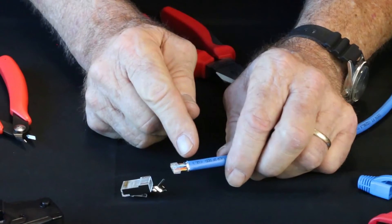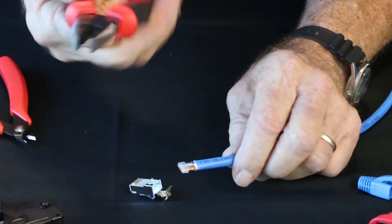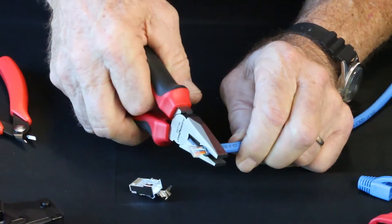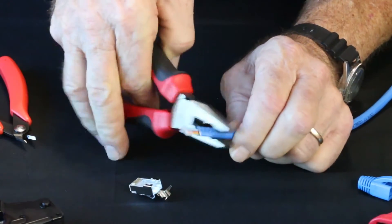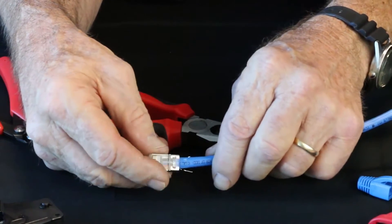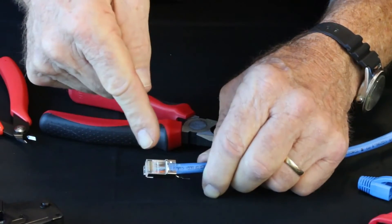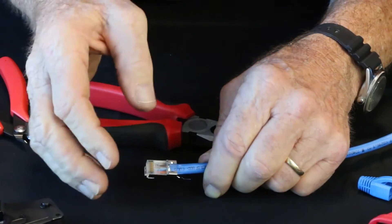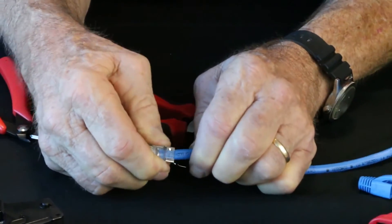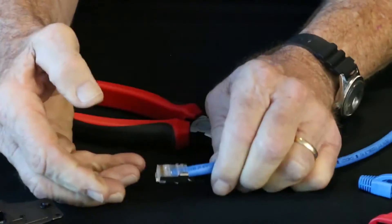Before I do, I'm going to take my cable, which is basically concentric, and reshape it a little to make it easier going into the connector. I'm going to use my lineman pliers — our new model 12206. I'll use the oval part, and the bar will help me determine how to shape it for the connector. Then we'll take the connector and carefully slide this in — the cable goes in. Now the wire guide bar stops before it gets to the contacts. We want to keep pushing the conductors all the way forward — they go under the contacts. See how the cable is going in? You can check the nose, and I have all copper in the front. So it's ready to be terminated.